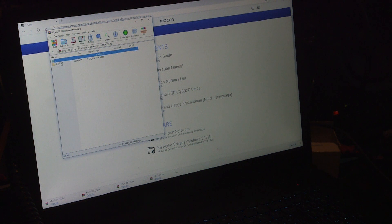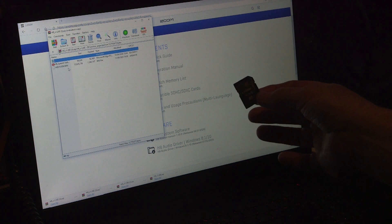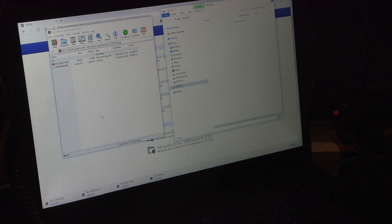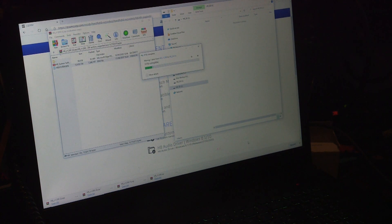So what we're going to do is — here's the file, double click on that and you can see there's an H8 system .bin file, and that's the actual software we need to update the Zoom firmware. What we've got here is a blank SD card, so we'll put that in the computer. It has to be blank, yes. So here we go, you can see it's come up on the right, it's completely blank. Format your card, then take the bin file, highlight it and drag it across to your card. So that's the system software on your card.